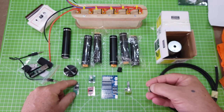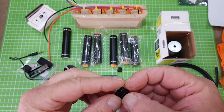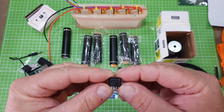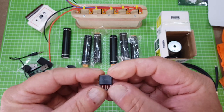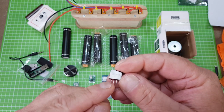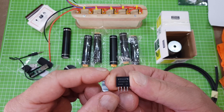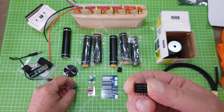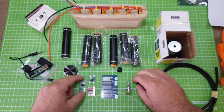Now doing it that way, we're going to create a ground loop, so we're going to get hiss on our speakers. So you'll need one of these — a DC to DC isolating converter. This will take our 5 volt supply and create a completely independent 5 volt supply, so we can eliminate our ground loop.